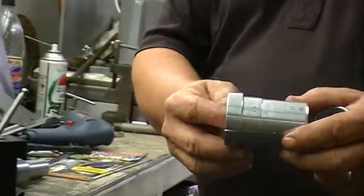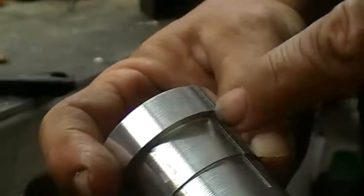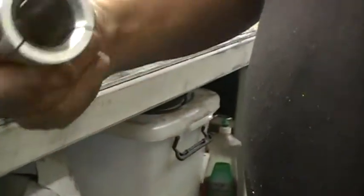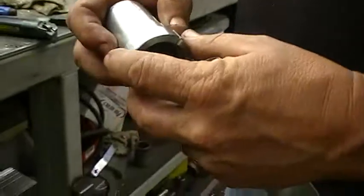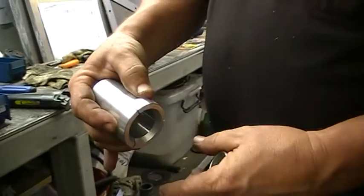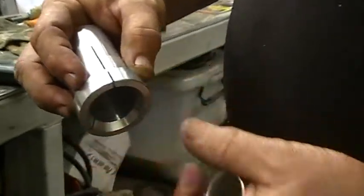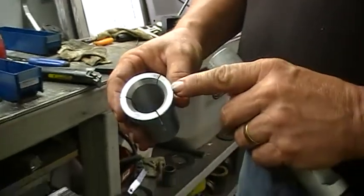Now if you look at this — come in a little bit closer — we've turned this in a couple different diameters, and we've split the sides of it in three, because we're going to do it in a three-jaw chuck in a lathe. That way we can grab each one of the fingers on the three jaws. We split it back and let this part back here act like the hinge. This is the diameter right here back on the hinge, and we've got the diameter out here so it can actually squeeze down a little bit without the jaws touching back here.